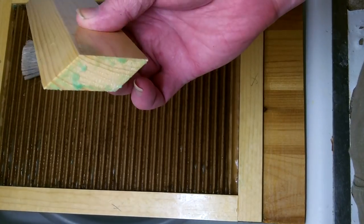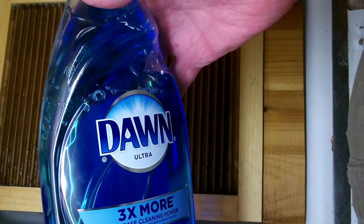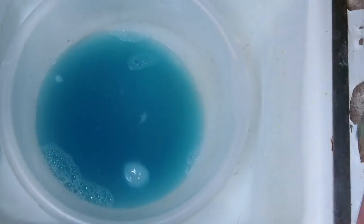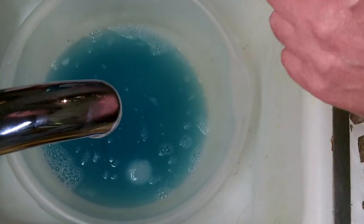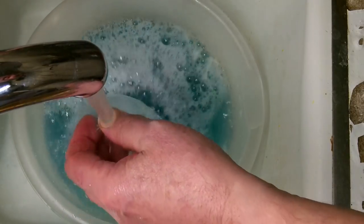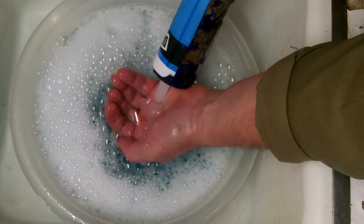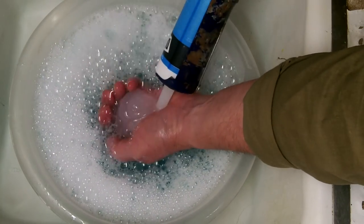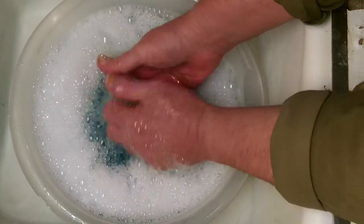Well, the big day is here. I made a little spreader bar to help smooth the silicone, I have about a one-and-a-half inch brush, and of course good old Dawn dish soap to coat on there to help the silicone release. To the water I like to add about 25 to 30 percent more Dawn dish soap — you want it to have a good concentration — and that will make for a good mold release.